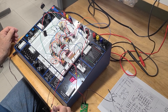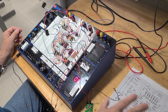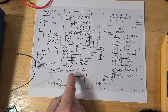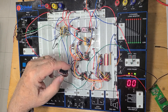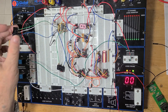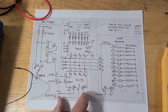I prepared about five logic probes to show you. This trainer is used for both analog circuits and logic. We built a logic circuit whose diagram is over here — it's a standard counter. The counter itself is a binary counter counting 0 to 15. Then we have a decoder and a seven-segment display, so if you watch the trainer, the numbers are going exactly like this.